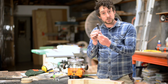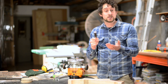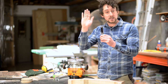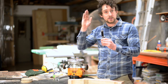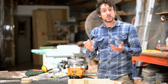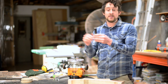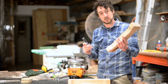Another really important thing about this heavy duty flush trimming bit is it actually has three blades rather than two, which gives you a lot more blade surface area and contact with the timber. These blades are also skewed rather than being straight in the axis of the shank, meaning the blade contacts the timber on a helical pattern rather than whacking a full blade length into the timber at one time. It's a really similar principle to using your hand plane on a slight angle or using a helical head on a planer. You'll get a really nice smooth cut even on big, chunky, heavy timbers like this.